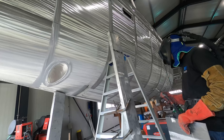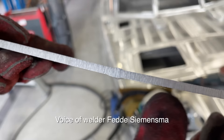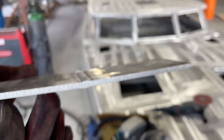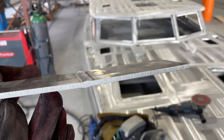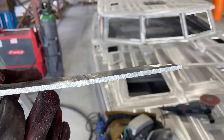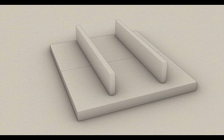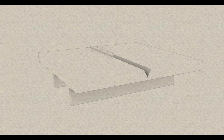I asked for a demonstration of the type of weld done to join the hull plates. They all fuse together like a plate — it's a good weld. The goal is to weld the plates together all the way through; the result will be one continuous plate where the weld completely joins both sides. The plates have been butted up against each other and carefully aligned. Often a bracing plate is temporarily tacked on to line up the plates perfectly, then tack welded — meaning very small welds to hold the panels in place, which will be removed later. Now the other side has a V-shape cut in it to make sure the weld can penetrate more than halfway through the thickness of the plate.